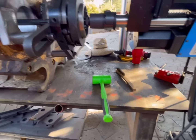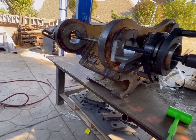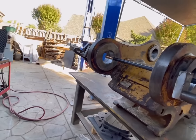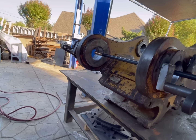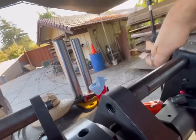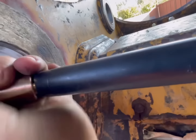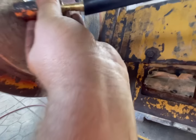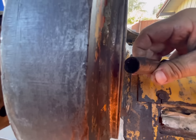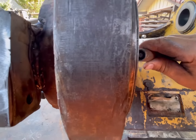Anyways, now we're gonna jog the wire. Actually, we're gonna retract it so the wire doesn't run into the bore. Okay, now we're going to hit wire jog and see if the wire is going to make it all the way through. Nah, I don't think so. Okay, so we're going to make sure that this is tight right here so that this can't rotate on us. Dang it, it's hard to do with one hand. Okay, we're gonna extend it all the way then.